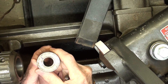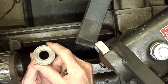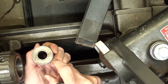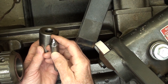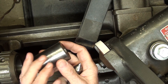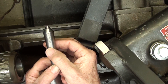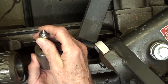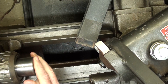This is the South Bend Heavy, and it takes a 5C collet, so it has a very large spindle. I have to use this sleeve for a number 2 Morse taper — they also make one for a number 3, I wish I had one. These are the centers that I'm actually going to grind. It's extremely important that you clean the spindle out and that there be no nicks whatsoever on the sleeve — on the outside or the inside — and that the center itself has no nicks, so that if you remove or swap centers they will all run true. So I'm wiping everything clean and into the spindle it goes.